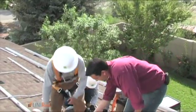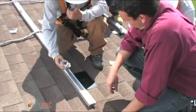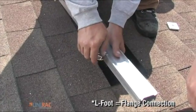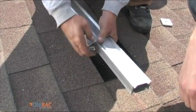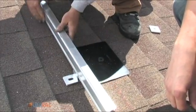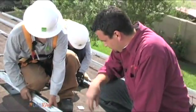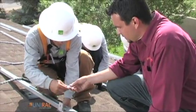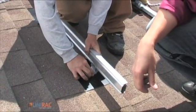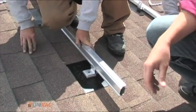What we've done here is we've already installed our flashing that our L-foot is going to set onto. Our L-foot snaps onto the rail like so, and you want to make sure they're facing uphill up your roof. You always want your lag bolt to be at the top of your rail system for support. This goes right in between here like that to give it more support and actually create a better seal so that we don't get a leak through the hole that's going into the roof.